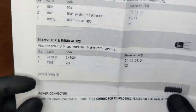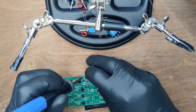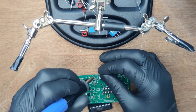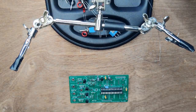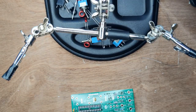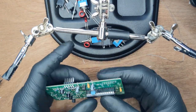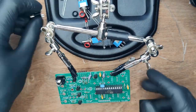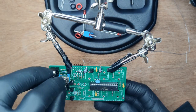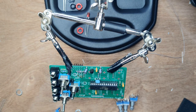Now it's time for bag B. Solder the power connector — solder two corner pins, check that it's flush with the board, then solder all the remaining pins. Now clean the board with isopropyl alcohol because you won't have another chance. Next, place the ATmega into the chip socket — by pressing the legs on the tabletop we bend them inward, making it easier to press them in. Then place the five jack sockets. Next up, the three switches, making sure to remove the washers and nuts. Place the six potentiometers.